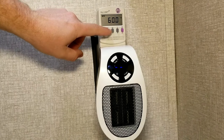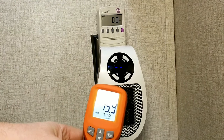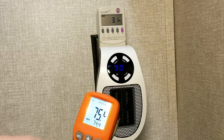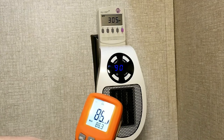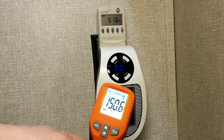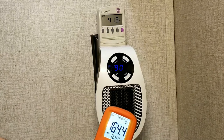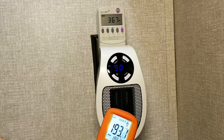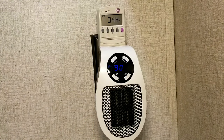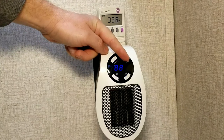I've got the watt meter up there. We'll show that it's running at 60 Hz — that safe, clean power — basically what the trailer is putting out being plugged in at the house. We'll turn it on and take another look at those temperatures as it starts to warm up. If you look at the watts, you'll see it blow past 500 watts for just a few seconds while it gets regulated and those coils heat up — that's where the big power draw is. After letting it run for a while, it hovers around 330 to 335 watts, just shy of the stated 350.